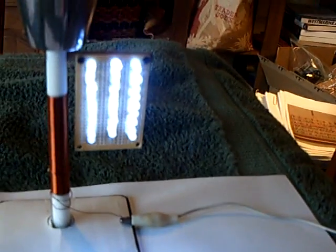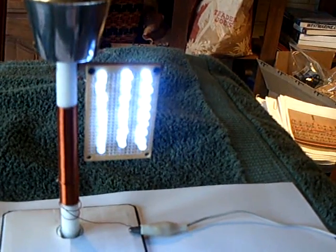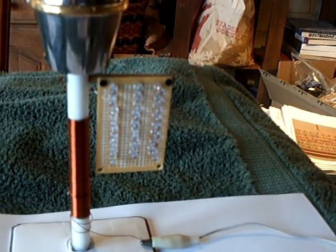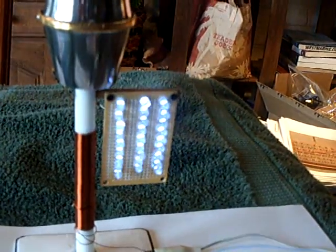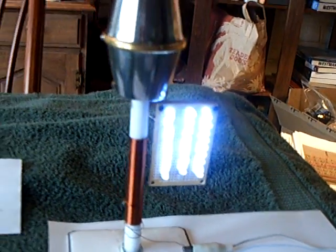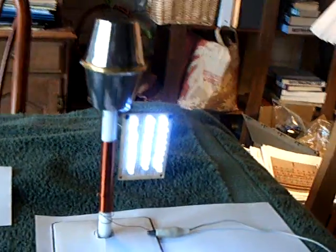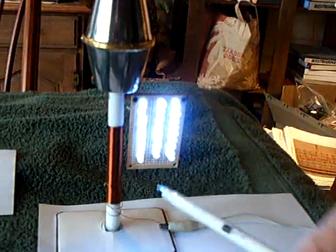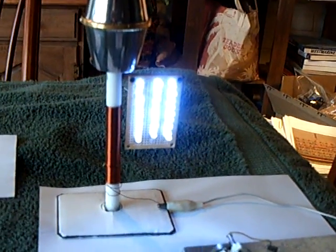With this variable capacitor, I can tune the resonance — tune it in and out of resonance — and that allows me the ability to tune the receiver. This was a great find to get some adjustment on the receiver part of the circuit. We were having some trouble with the receivers, and this is the way I figured out how to control that situation. The doctor explained pretty well what's happening with that coil and resonance.